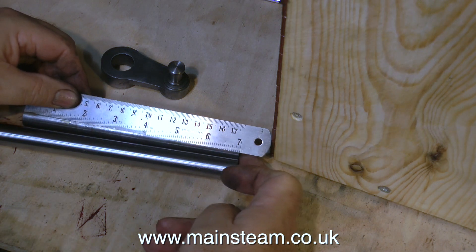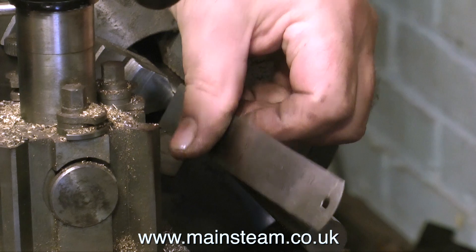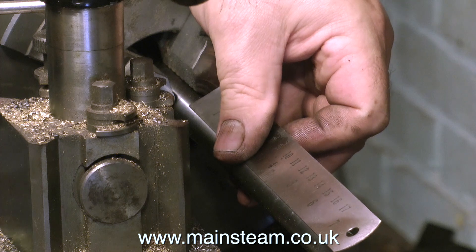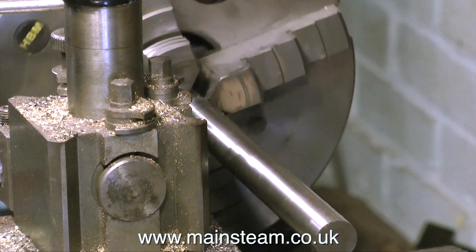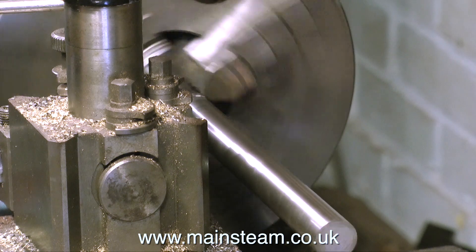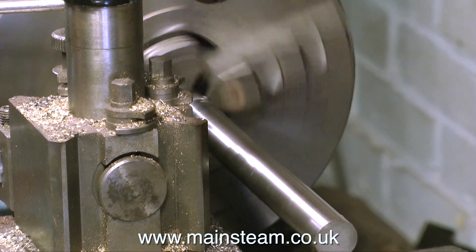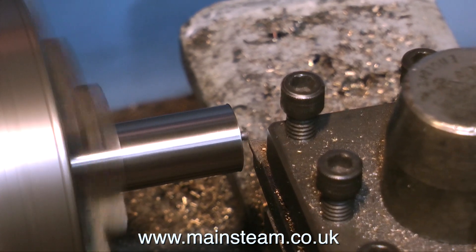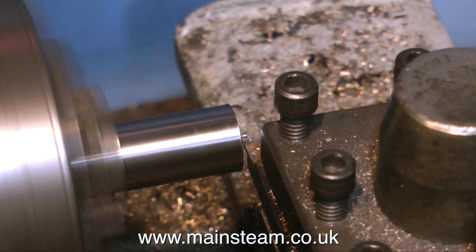It's a very simple job. I need a seven-inch long piece of silver steel, so I'm putting a larger piece of silver steel in the chuck — this is on the larger of my two lathes. For this parting off job I'm using a high speed steel parting tool, so I've slowed the lathe down because if I go too fast the tool will blunt very quickly. This silver steel is a very hard material. My old Smart and Brown lathe, a model 1024, is a very substantial machine so parting off is no problem, but it is quite noisy especially as the belt slips — and the reason I have the belt slipping is so if it locks up, the belt slips and nothing breaks.